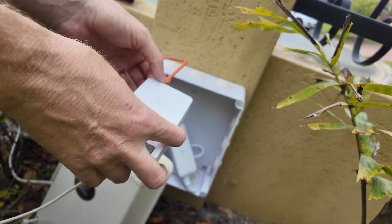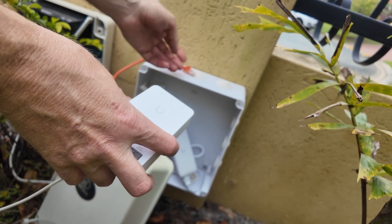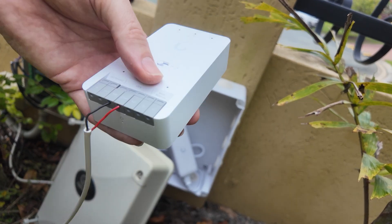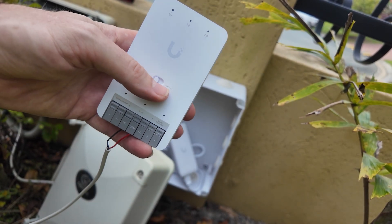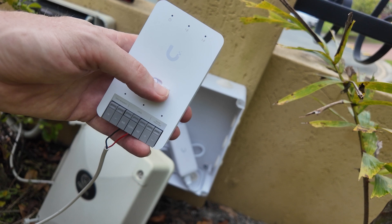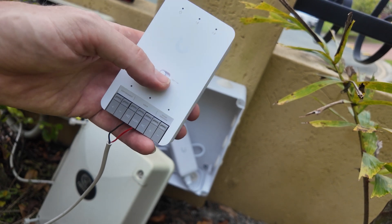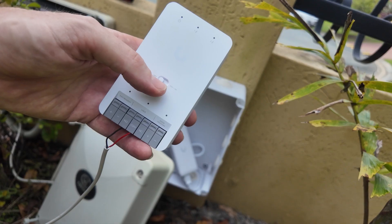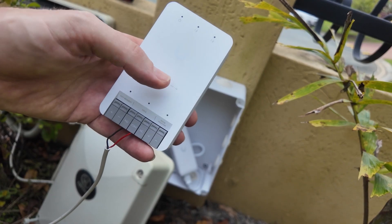What I'm actually going to do is unplug the hub mini now while I just get the cable through and set up, so there's no chance of any shorting. You'll also see I've turned this off - it's not set on 12 volt. We're running dry contacts; we're not actually sending any power from this device, we're just closing a circuit, so that's why that is switched over there as well.